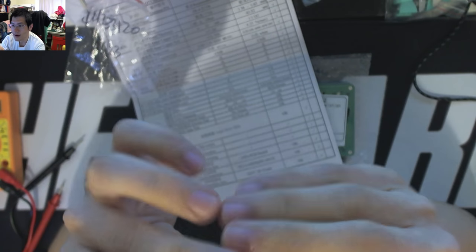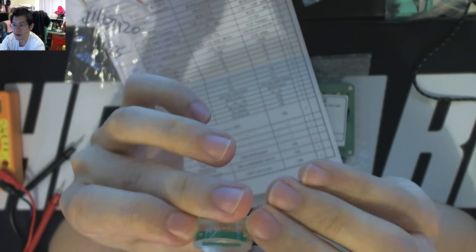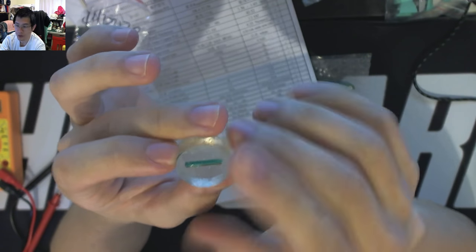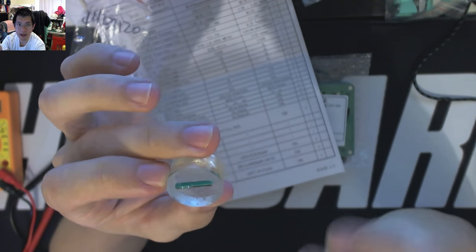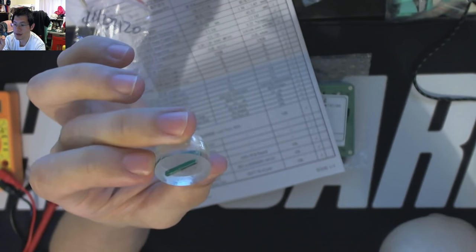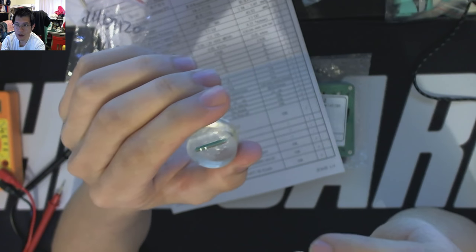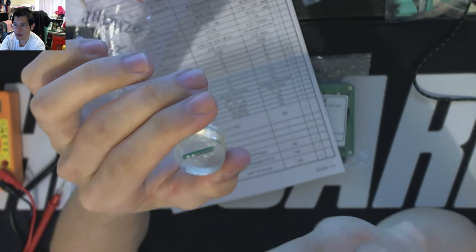Now, I can already see that the level that they've done here is very rough. It's very, very low polish quality because they would only be looking at this from an optical microscope point of view. Whereas the specimens that I used to prepare in the lab were actually for electron microscopy, where we would be polishing samples down to like a diamond 0.1 micron silica suspension or a diamond suspension. And we would be hand polishing by the end of that rather than a machine polish.